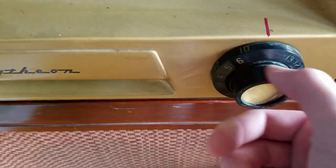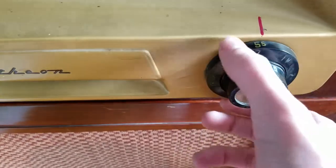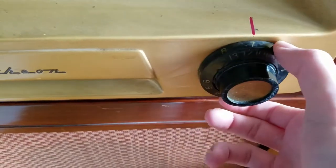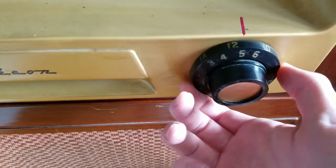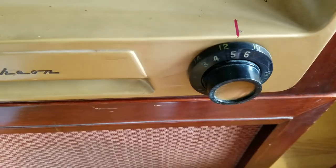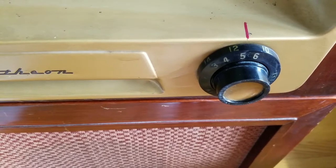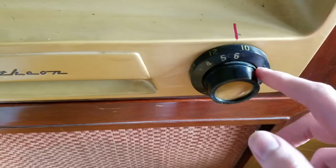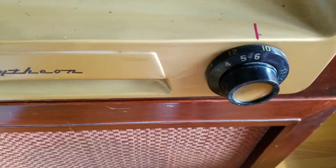What's in between 6 and 13 — unless that's where the FM band is, if this has the ability to receive FM. Because FM is in between channels 6 and 7. It's not that hard to add FM when you have a continuous tuner like this, because TV sound is already FM decoded. So it's just a matter of adding the reception in between channel 6 and 7, and you've already got an FM radio there — it's just the same sound decoding.